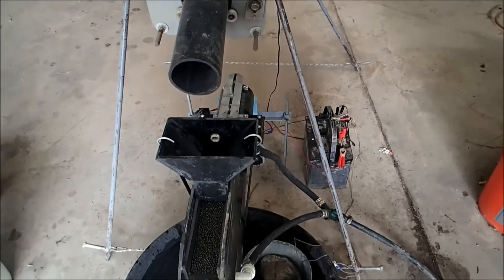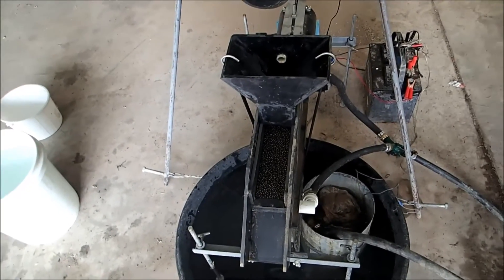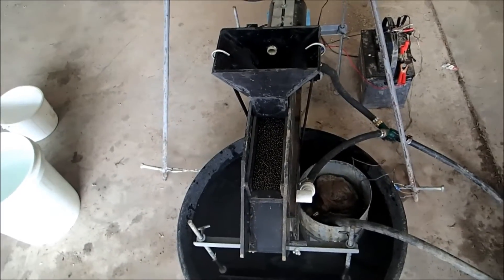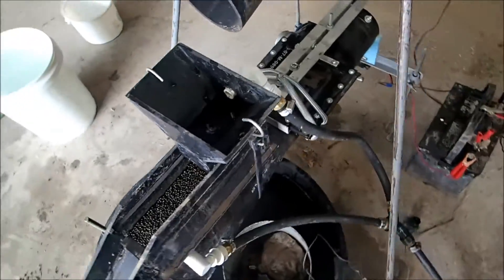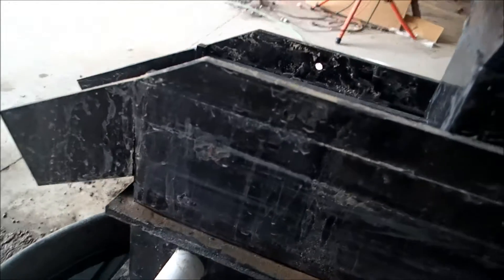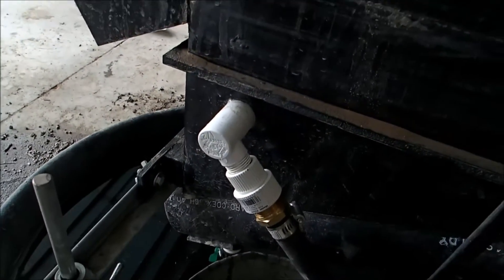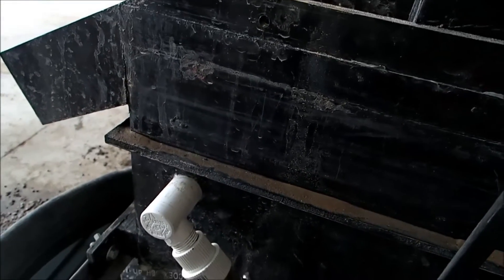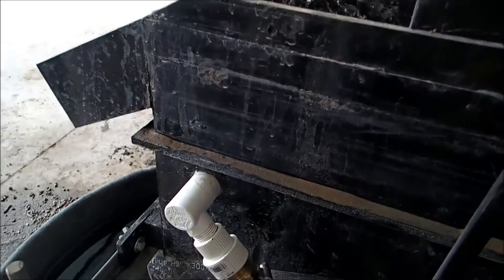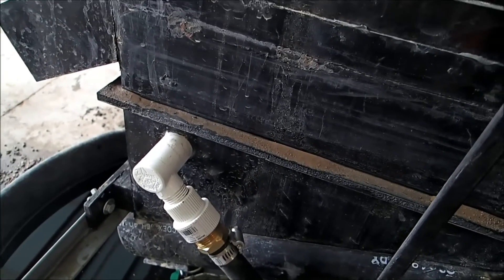What I decided to do rather than get a larger shot — generally the larger the ragging the more cons you get and we're trying to get fewer cons — so last year after I got back from the big lost, I added a water inlet down here in the hutch. The idea is to reduce the suction stroke pulling material down through the shot bed on the suction. You add water there and that reduces that.